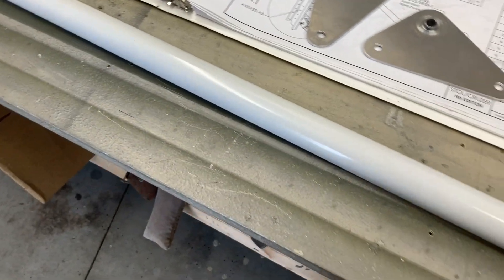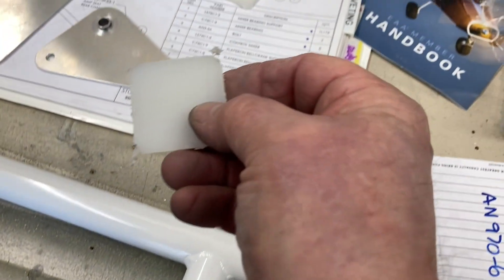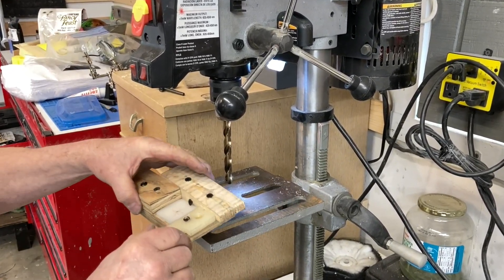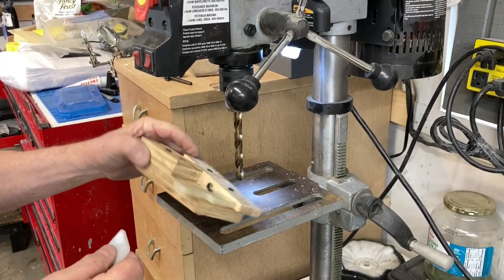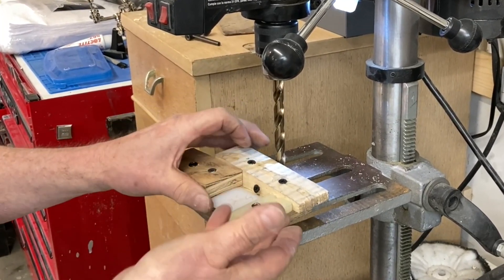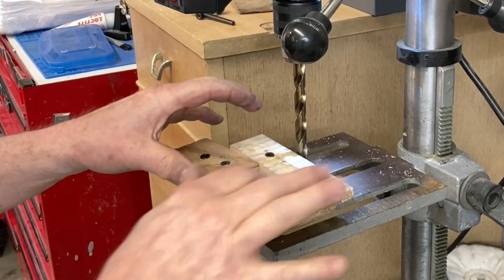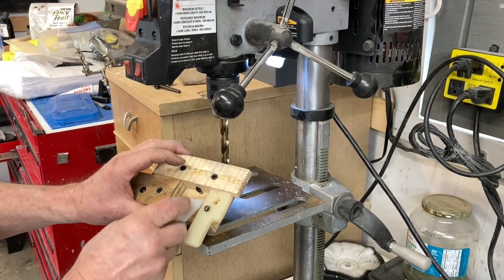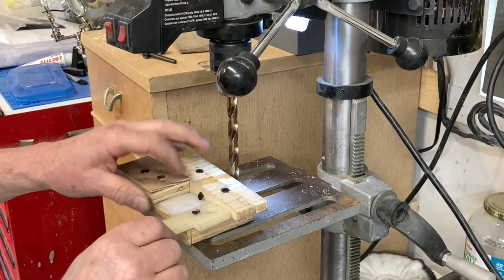This was a little bit hairy. I just took a bunch of scraps I had and screwed them all together on a piece of plywood. I put a screw on the other side because it kept wanting to lift up — twisting wasn't the problem, lifting up in the back was. So this little jig really helped a lot and made it safer.